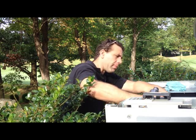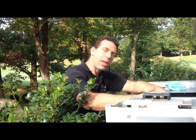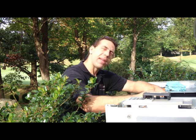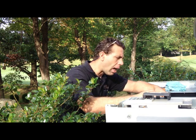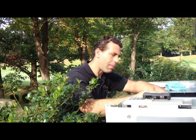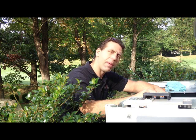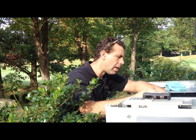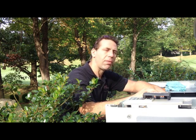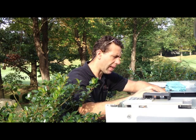There are several other things that are part of the Generac servicing. One is to check and/or replace the battery if necessary. I also check all the connections to see if anything has vibrated loose, because generators tend to vibrate a lot. So I like to check all the terminations to see if anything has worked itself loose or corroded.